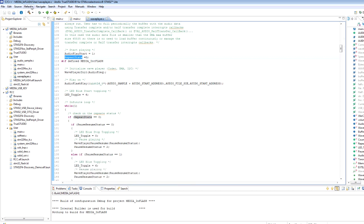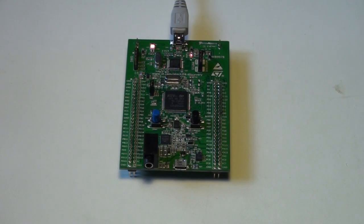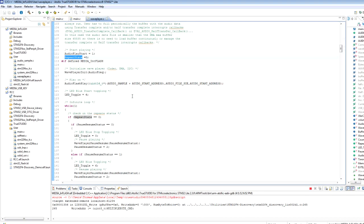So let's test that by pressing the little bug up here, which will start the debug. It will transfer the compiled file to the board. You'll see that the debugger starts blinking, and you'll notice the LED stop blinking from the other example, as it's now programming the so-called elf.elf file into the board. And this might sometimes take a while.